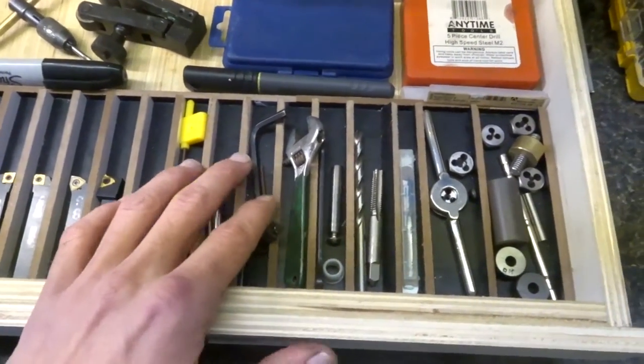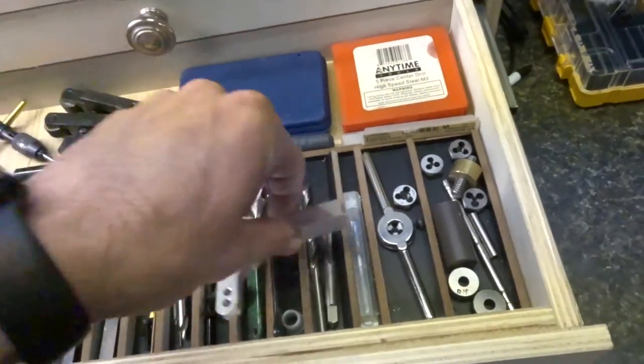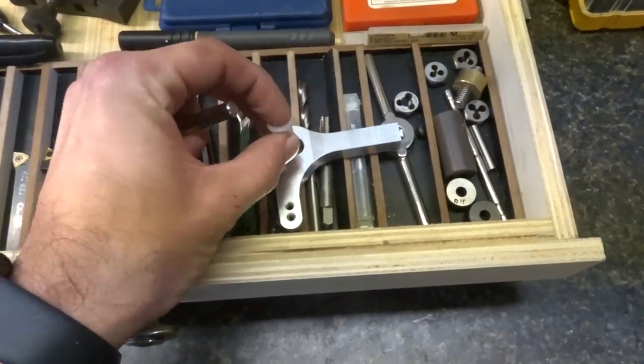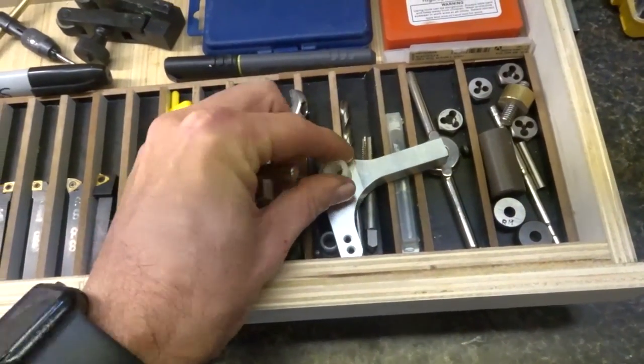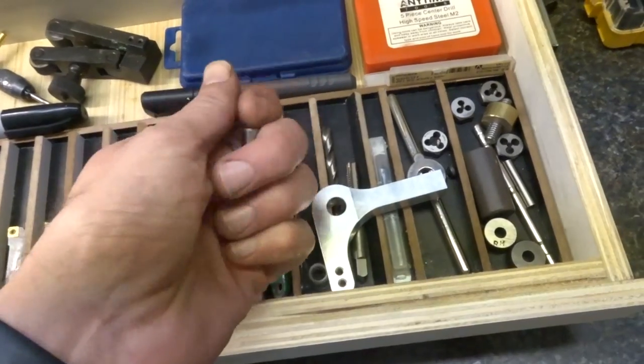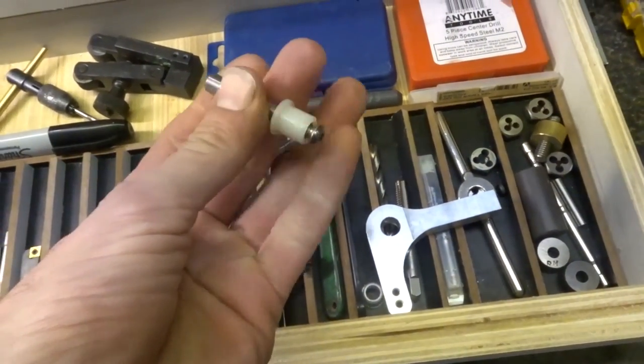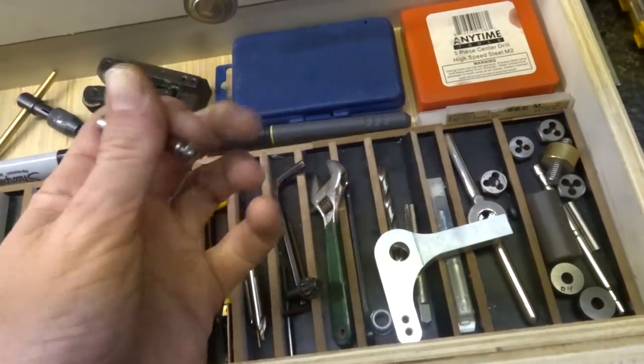And, you know, I've got all my different parts. This is what I use for when I put the actual flange bearing into this. It's a little tight. So I take this guy, mount it on here. I'm trying to do all this one-handed. Put it in the lathe and turn it just a little bit. And then it makes it where that part will fit in there better.